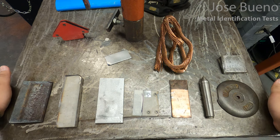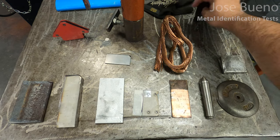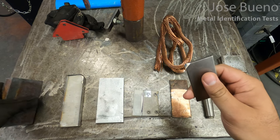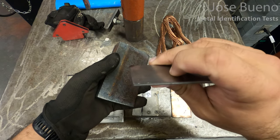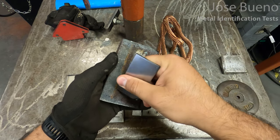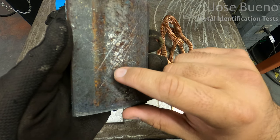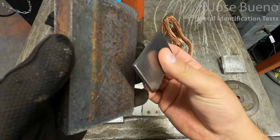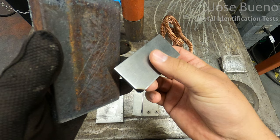I'm going to begin the test by using our control piece to scratch the first specimen, then examine the scratch to tell if they are the same metal or if one was softer. I'm going to use the corner of the control — probably the sharpest area — and just attempt to scratch the surface. As we take a closer look, we see there are some scratches. They're not too deep, so this isn't any softer than the control, but they're also not superficial. These are real scratches in the surface of the metal, so we can start to guesstimate these two metals are very similar. They are in fact the same type of steel.